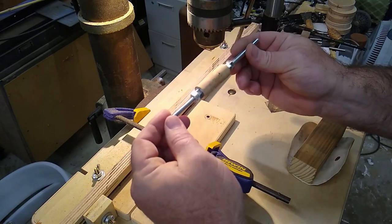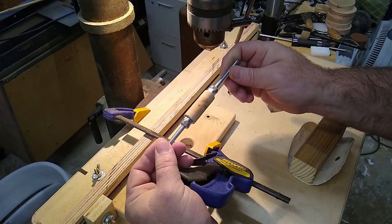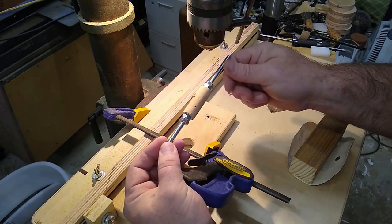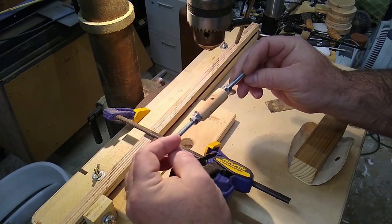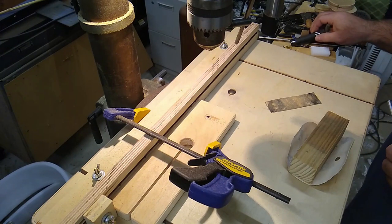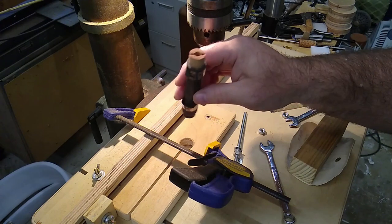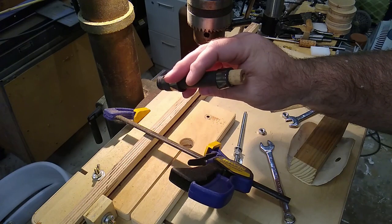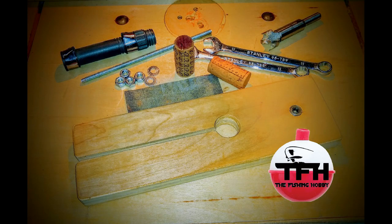You can realign this end of the jig the same way I did the first end — just put your mandrel in there, put the jig on, run the mandrel down into the bearing, then move your fence and stop back into position, clamp everything down, and you're re-centered and ready to go. That's all I've got for this video. I hope you enjoyed it and can find some use for this jig in your shop. If you've got any comments or improvements for the idea, just leave them down in the comments below. I appreciate y'all watching — I'll talk to y'all later.